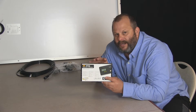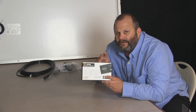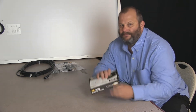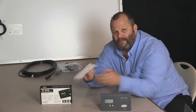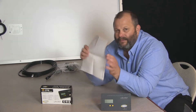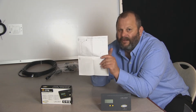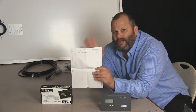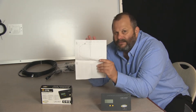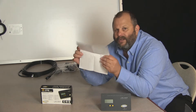Let's take a closer look at the Go Power PWM30 charge controller — this is the charge controller included in the 160-watt kit. When you're going to cut out the hole for the charge controller, if you turn to the last page of the manual, you'll find a template for easy installation. Make sure you use this — it keeps for a clean install. Go Power has done a real nice job in making sure your install looks as professional as possible. Take your time and use the information they provided.